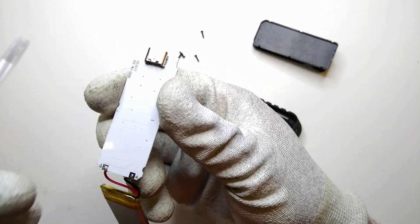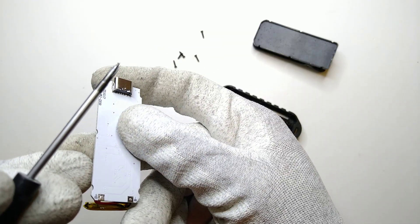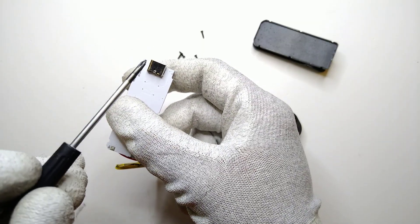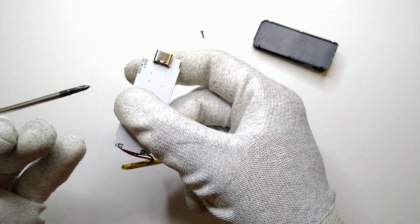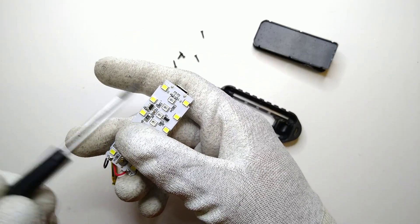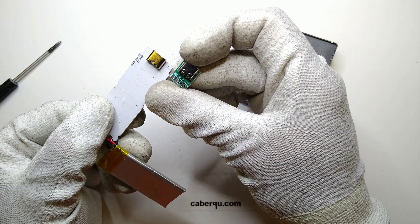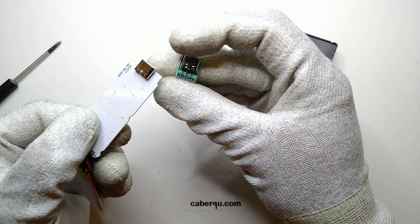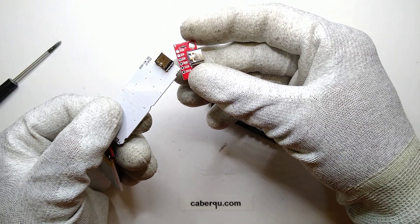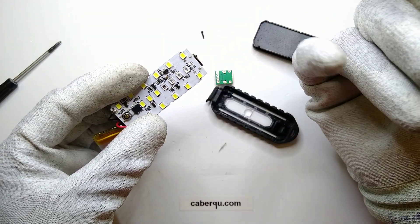But what you can also clearly see is that the USB-C port here has no pull-down resistors, so there's nothing going on. They've just pinned out the power and ground — so the 5V and ground rail in this case — and no CC1, CC2, or even D-plus and D-minus for data connections. That's something I wouldn't expect of this device in any way. So what you can see is that this USB-C port is pretty much identical to what we see on this breakout board — just ground and VCC or VBUS, 5V, but no pull-down resistors — when it should look like this, where you have CC1 and CC2 connected with those two pull-down resistors. Like I said, costing basically nothing. In manufacturing you just have to know about them.